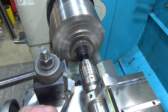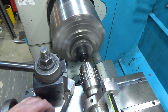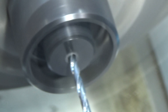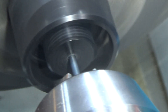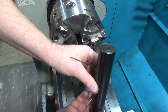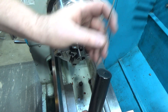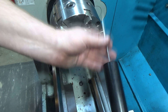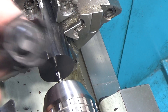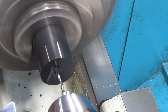We're going to try to be accurate, so we'll start with the center drill again on this side, choke up on the drill bit to get it started, then switch to the bigger drill bit. We found the center of the other hole — excellent! The hole went all the way through. Now we need to do the needle test: the needles will go in pointed side facing the opposite direction since that's the side that needs to be welded. They don't catch in the middle — I don't feel a ridge where they could hang up, so I think we're good. Next up we're going to make the mating piece.